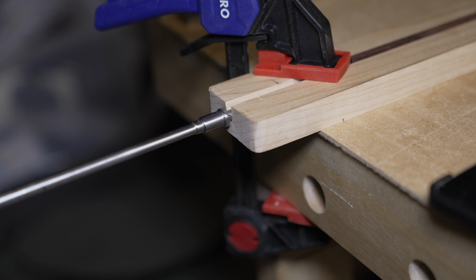The neck is cut out, the truss rod slot is done. All I really needed to do to progress further was to create the right shape at the end of the truss rod. I've got a tool for that, it's called a reaming drill bit. It reams a nice hole in at the end. And then get the truss rod in, and I could start working on some fret slots in the fretboard, cutting the fretboard to the right shape, and I could stick it on. So I go back down to the workshop as normal, quite excited to carry on. And then, yeah, well, you'll see what happened.